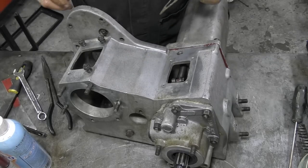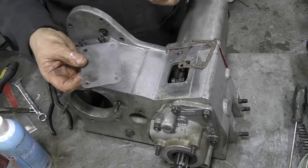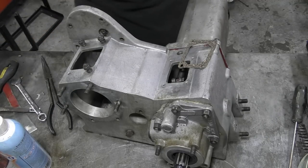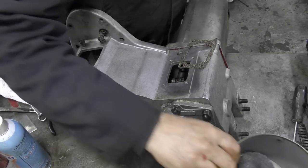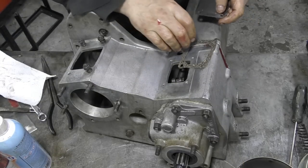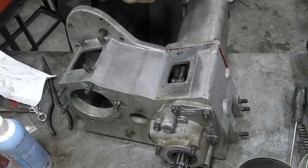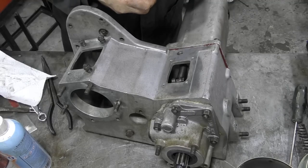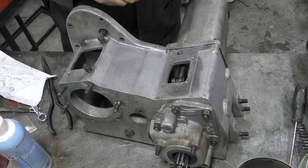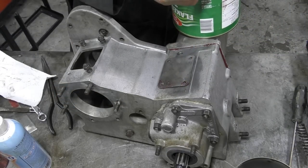The little cork gasket for the top — cork rather than paper because this is pressed steel, it can warp and twist. Again we'll put a bit of grease on it, nice coating of grease on both sides. Cover on, little bolts in.